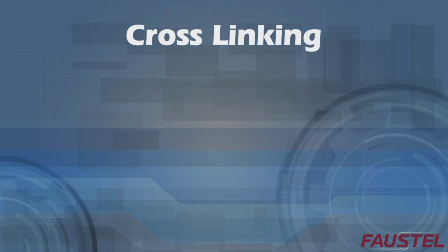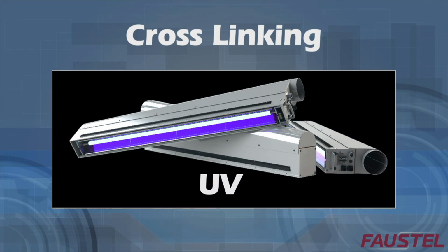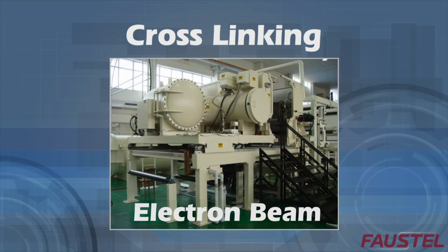Some laminating adhesives use UV curable or cross-linking components. In this situation, the laminated structure would need to pass through a UV or electron beam curing system in order to achieve a complete bond between the webs.